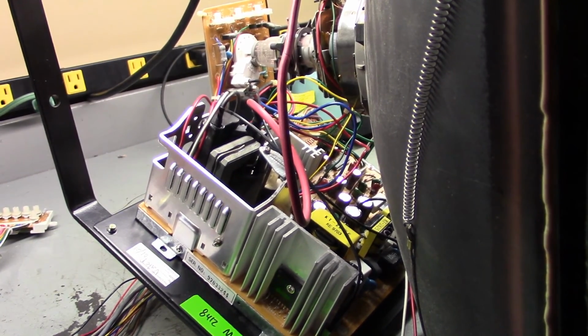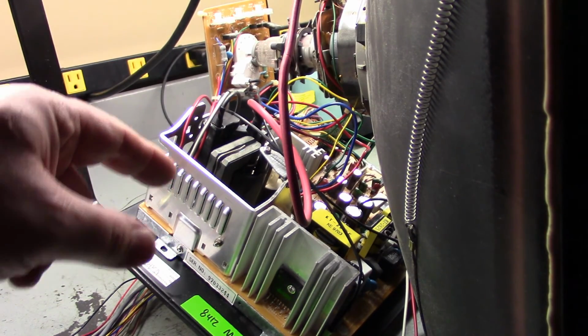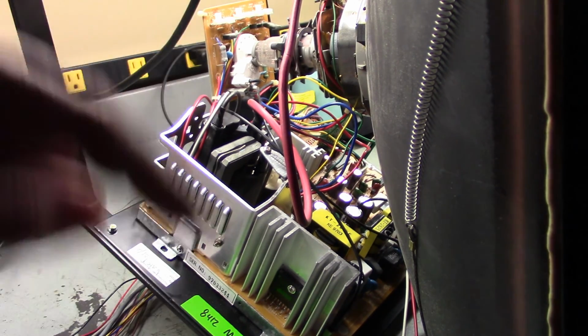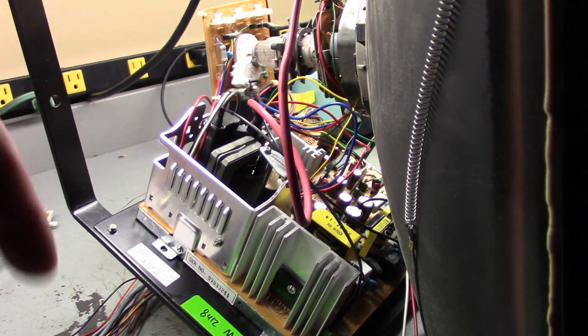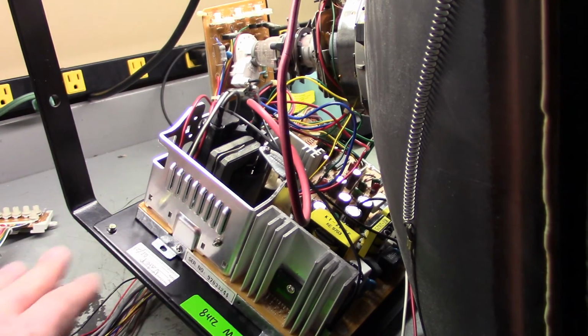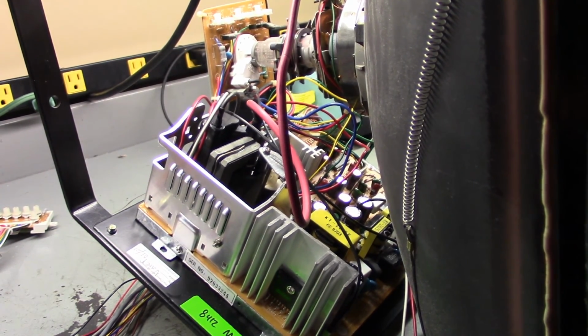On the standard resolution version of this chassis, the C909 location is an empty hole. And D903 is also not populated, and there's a jumper going across the inputs. So that is the main visual difference, and on the medium resolution, C909 and D903 are populated. So if you took these, the standard res and the medium res, and put them side by side, except for that capacitor and that diode, they are visually completely and totally, utterly identical.